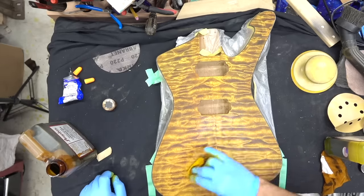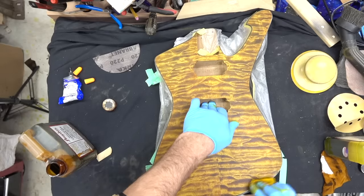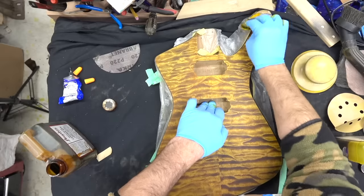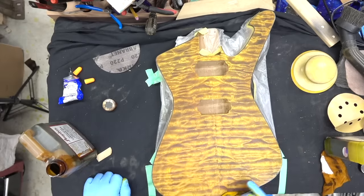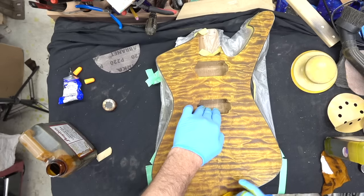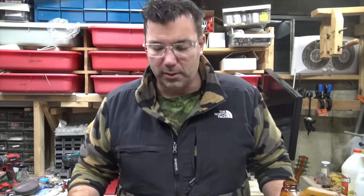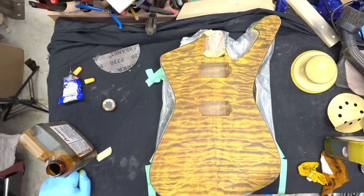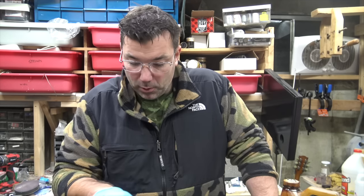Adding the yellow pulled that splotchiness out. I guess it's the darker color that is causing the issue. Getting a little bit of off coloration on the side, right here where I had that grain run out — I got a little weird coloration issue. That looks outstanding. It could be a tad darker, but that darker stain is leaving some blotchiness, so I'm not sure that would work. The trick here now is to let this dry for 24 hours. We'll come back with the steel wool — the steel wool will help just pull whatever color is on top and just get it to pop slightly.